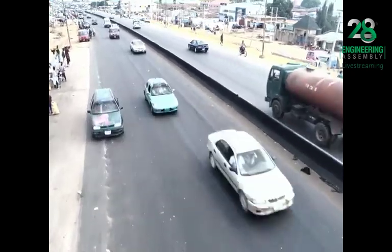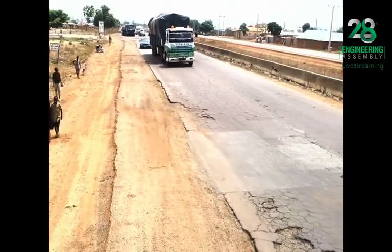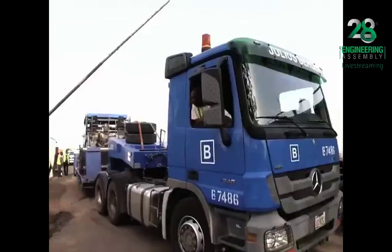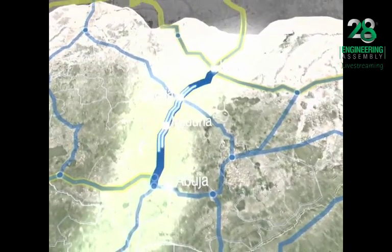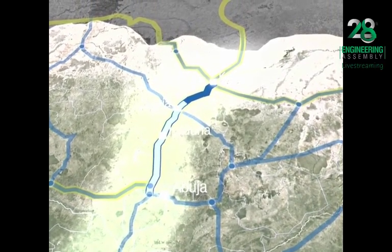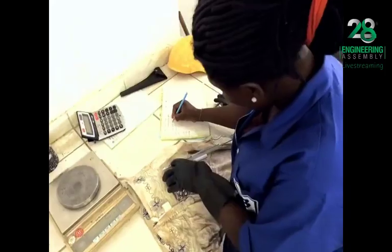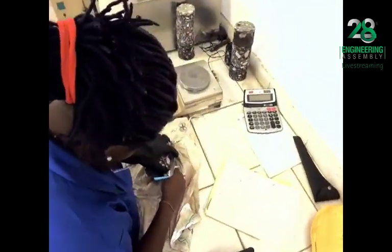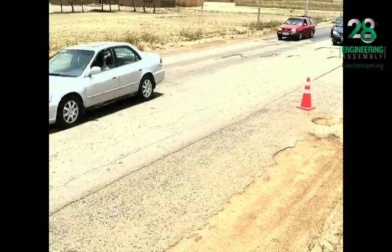As such, its functioning is of national priority. To address the poor condition and deterioration of this priority road, Julius Berger Nigeria PLC is contracted to rehabilitate close to 380 kilometers of the dual carriageway from the Federal Capital Territory Abuja through Kaduna onto Zaria and further north to Kano. Ongoing technical tests, including topographical, geotechnical, and laboratory investigations, examine the extent of asphalt damage in view of the load and environmental requirements.